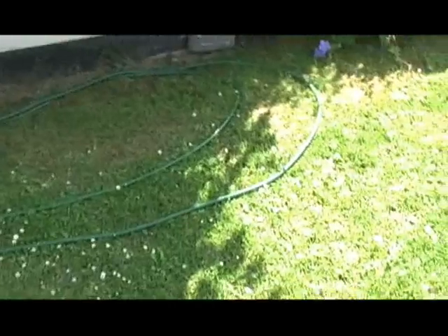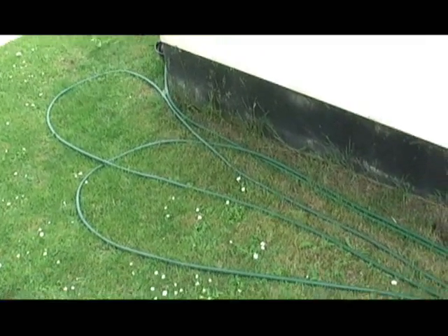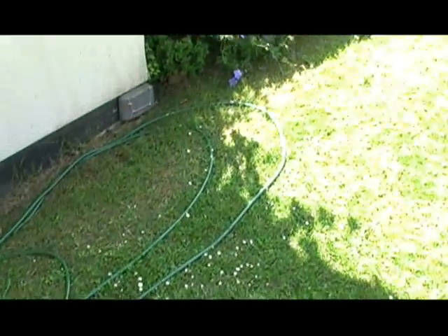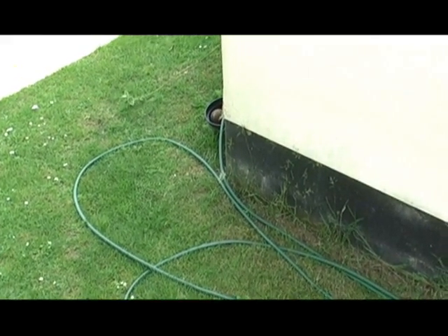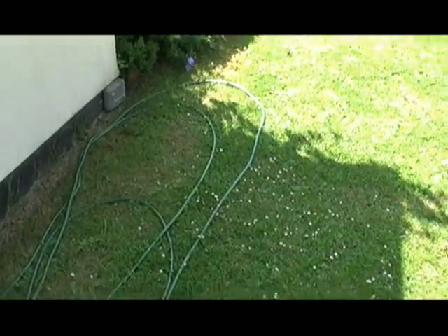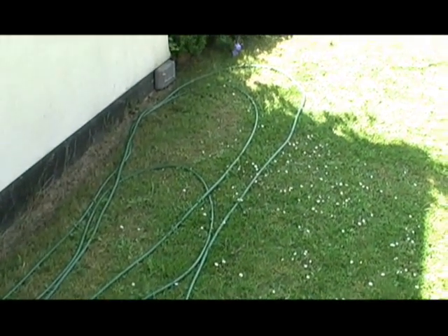When the sun comes around here in the afternoon, this hose pipe absolutely boils. In our previous house, where we had more time and bits and bobs to do things, I had hoses like this strung across the conservatory inside, and a black-painted box with a radiator in it — an old household radiator — connected to the mains. It came in at the mains, went through the system, in through a window frame, where I had a third tap above our kitchen sink. When you turned on the tap, the mains would push the cold water in, and you'd end up with a bowl full of hot water out of the pipe — enough to do your Sunday washing up with, grease and all. All the black stuff for your swimming pool is even better.